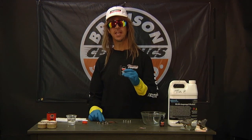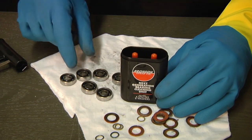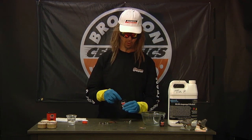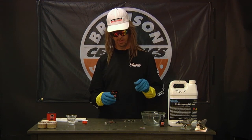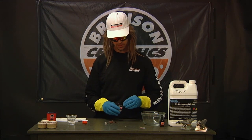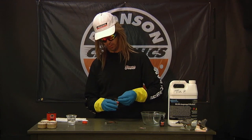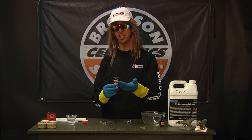Place the bearing, washer, and spacers in the unit in this order: bearing, bearing, spacer, bearing, spacer, bearing, then half the washers — which is four. Now make your second kebab: bearing, spacer, bearing, spacer, bearing, your four washers, and your final bearing. All your bearings, spacers, and washers assembled in this shish kebab of speed.